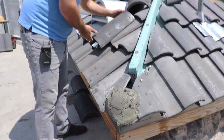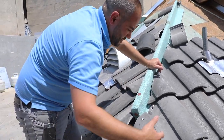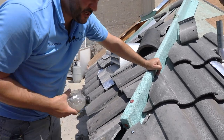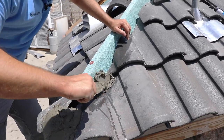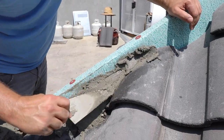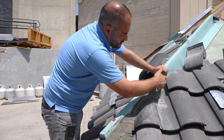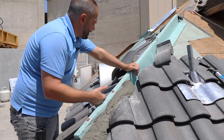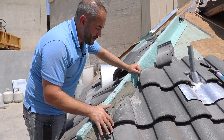Before we install the hip, we're going to continue on and apply mortar to the sides. What that's going to do is close up these gaps here. You constantly want to keep it wet. The mortar here serves a two-part purpose: the first being that it helps block out those larger holes, so in case there's wind-driven rain, it's going to stop it.